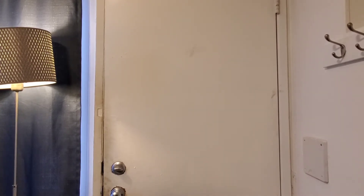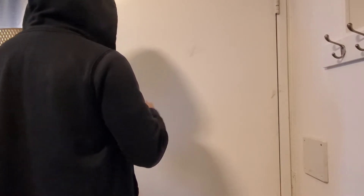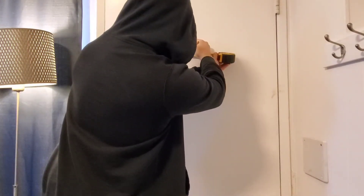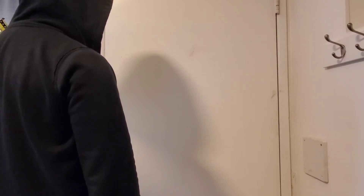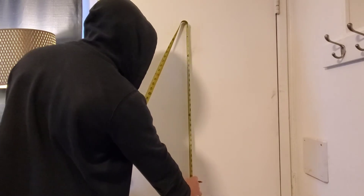The first thing we're going to do is figure out how wide our door is. Our door is 34 inches, so I'm going to split the difference — 34 divided by 2 is 17. You want the viewer right in the middle so it looks symmetrical, so we'll mark 17 inches right there. For the height, it's really subjective to what you want. I'm a little short of six feet tall, but I'd say around 5 foot 3 is a good universal height — shorter people can use it comfortably and taller people just have to bend down a little.